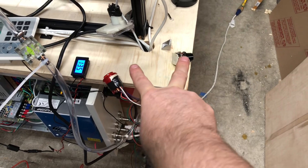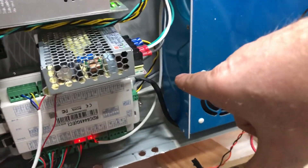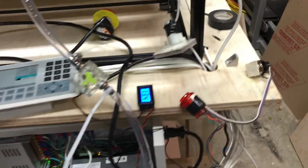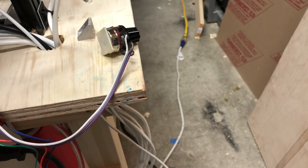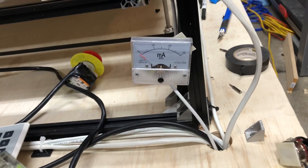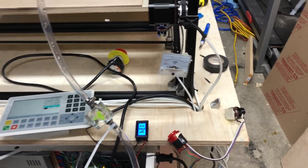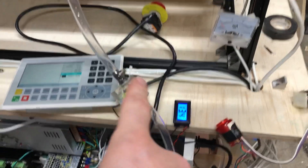I tuned using the button and potentiometer and made a separate plug for my Cloud Ray supply, so that little hole in the side has a little potentiometer in it. I tuned it such that max power on the potentiometer can only give me 23 milliamps, which is my technical max for running the tube. And I got my little water flow meter there.